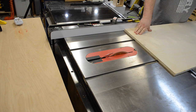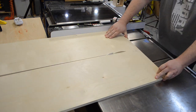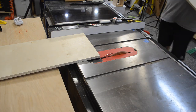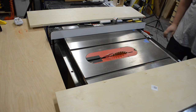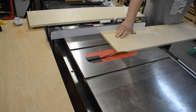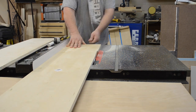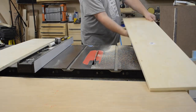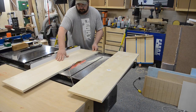I was gonna build this project out of plywood, so I started with ripping the plywood to roughly in half. I didn't get to an exact measurement, but then I could slide my table saw fence over slightly and trim both pieces so they're exactly the same in width. I often like to do this when breaking down sheet goods because you get a nice clean cut and you can sneak up on your exact measurement.